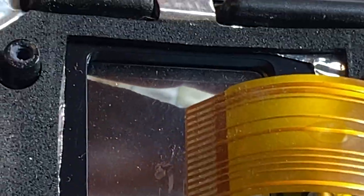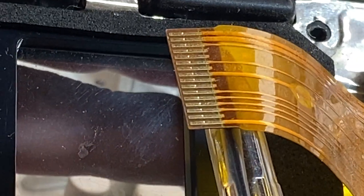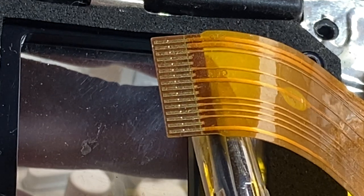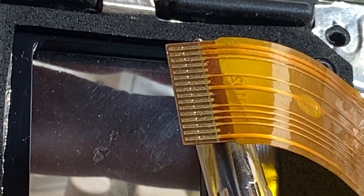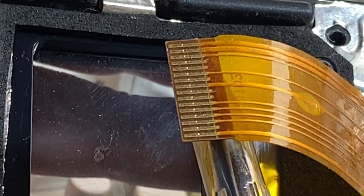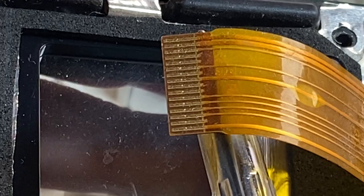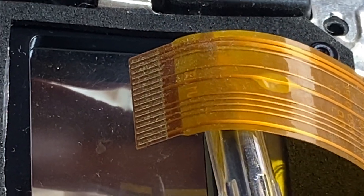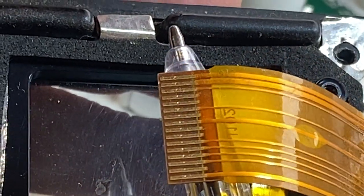Now, on the other end of this Mylar, which goes into the display board, you've got this thing here. Same thing. See where it goes into the connector, they push in the middle. That is a breakage point. Give it a haircut. All right, 2 mil off, stick it back in. If you're having any sort of strange control function problems, you can just redo that.